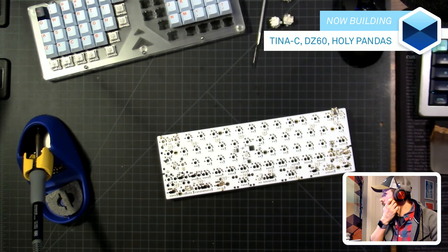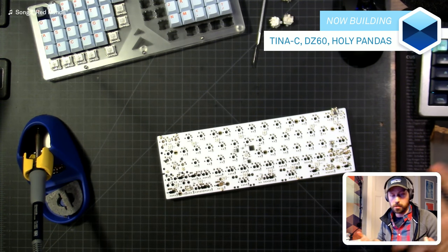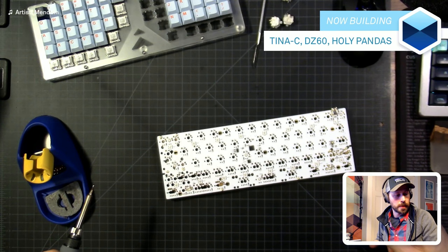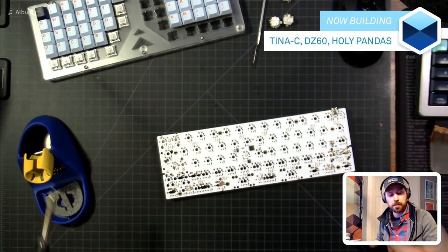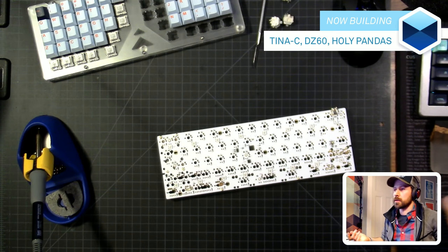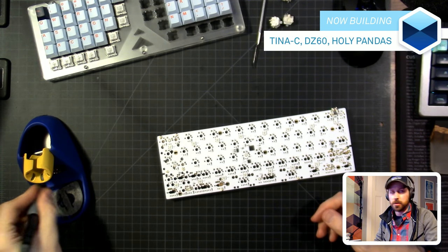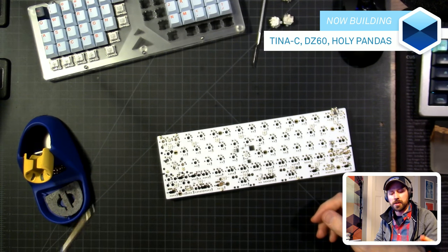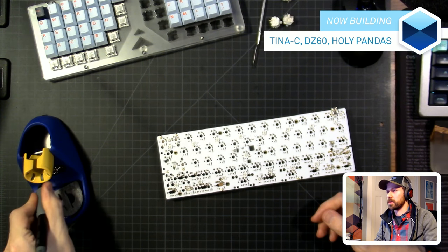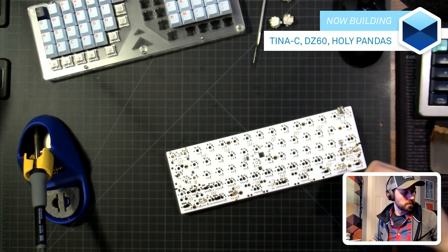Creeps me out how fast a soldering iron can get up to 555 degrees. Like, it takes 7 seconds for this thing to get up to that hot. Actually, this is the longest it's taken, which was about 15 seconds. Normally, it's very quick. I knew nothing about soldering coming into soldering, so I just read what's a good temperature for soldering for this sort of application, and the answer was somewhere around 500 to 550. And at some point, for some reason, my solder got set to 555, because it's got kind of an arcane way that you have to change the temperature, so I just left it there. I've never had a problem.